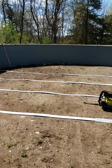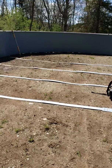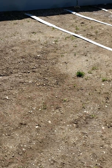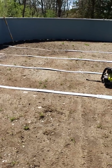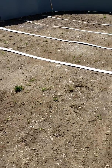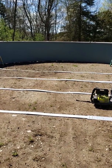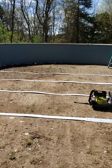I wanted to talk about stones and rocks and getting ready for the sand. I'm in upstate New York, and anybody in the northeast knows we have this great packing soil — super hard soil, but we've got stones and rocks. Compacted flat stones don't worry about, they'll always lay flat under the sand. It's your loose pebbles and rocks you've got to get out of there. Best way to do it — I've got the backpack blower right there. Hit it quick, separates your loose dirt from your stones, pushes them all to the other side of the pool. Get everything over there, hit it with a push broom into a pile, shovel it right out. Done deal — forget the rake, don't waste your time.